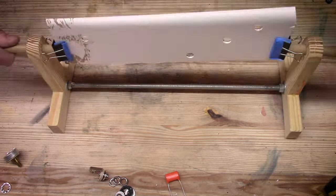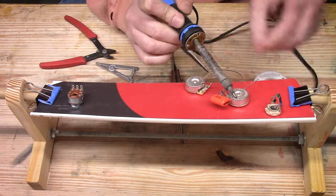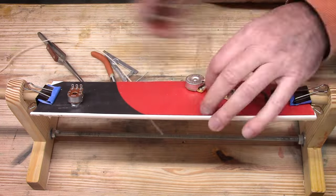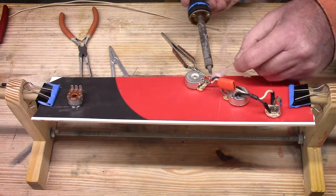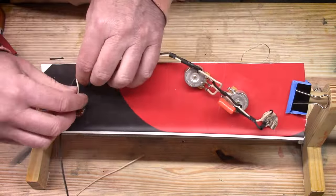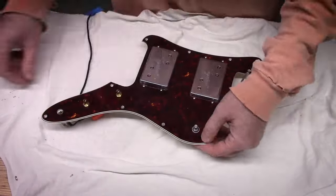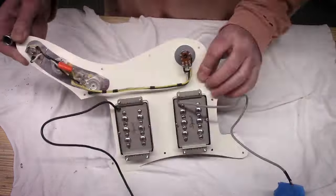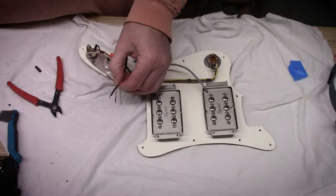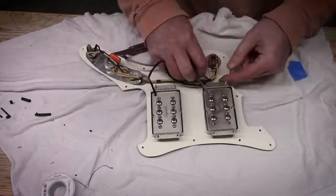Here we're going to take a quick look at the wiring monstrosity I put together to get this guitar wired up. This is option one wiring, which wasn't what either I or the owner were expecting. Option two removed a jumper ground from the blend pot, which helped greatly. But the output from the tone was still pretty flat, so we moved on to option three — basically a double humbucker, single volume, single tone, six-string guitar type wiring — along with going from a 250k to a 500k tone pot, which gave the extra versatility this bass needs. Huge difference from option one.